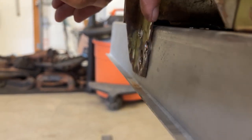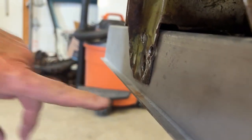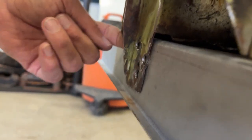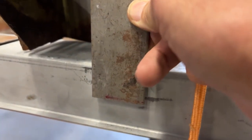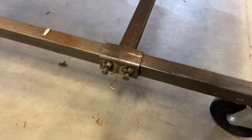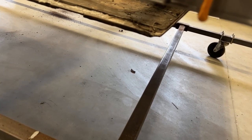And I'm looking here real close and I do notice that because of this angle, this flange that welds to the rocker is very straight, which makes the rocker flush with the outside. So what I'm gonna do, I'm gonna bolt this right there, put a piece of sheet metal on the inside, for instance, this scrap piece I was testing again, right here, and I'm gonna do this. And what that's gonna do, that's gonna give me the proper location left and right on this unit.